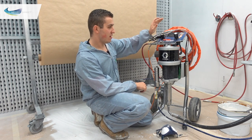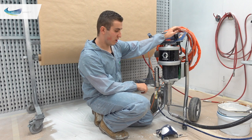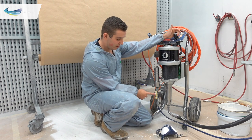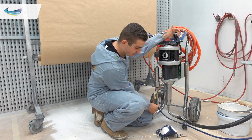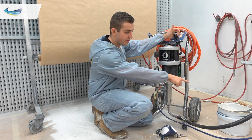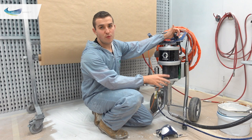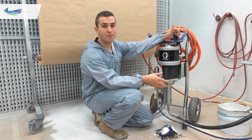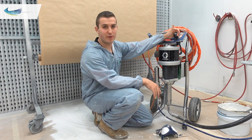Open the ball valve — the pump is now ready to start going once we adjust the regulator. We've got the ball valve open so the paint can circulate through and come out of the tube into the bucket. Once it's coming out evenly and smoothly, we know the pump is primed and we're ready to send it down the paint hose.